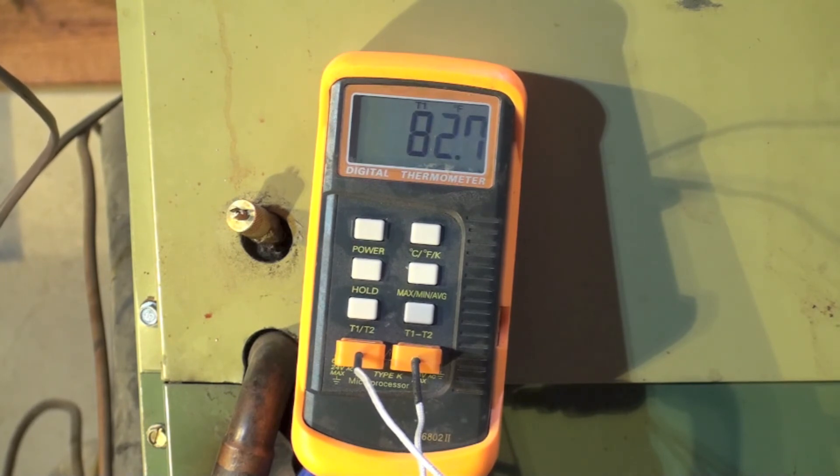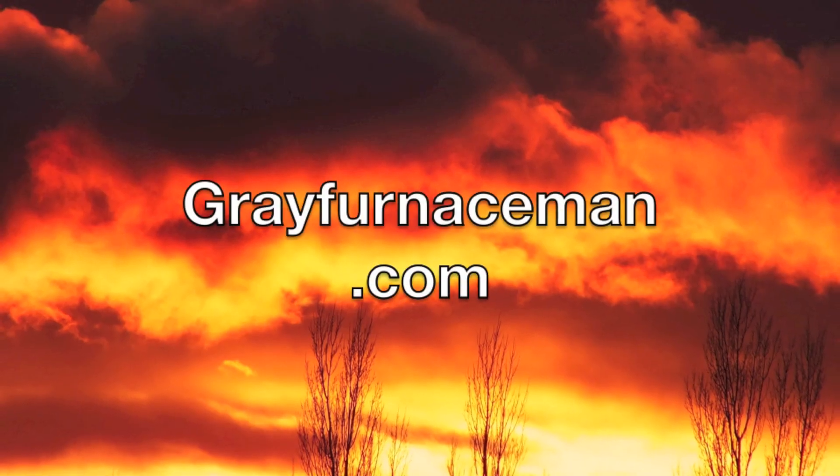82 and a half is a pretty low temperature to be sending into somebody's house. It will heat the house because it's warmer than the return air at 67, however it is going to feel cold to the customer. Once you reach the lower 30s in your outdoor temperature, you have a choice to make — or maybe your customer has a choice to make — on whether you should continue running the heat pump. The compression ratio is getting wider as the outdoor temperature drops, so you don't get as much heat. A lot of pumps probably shouldn't be run much below about 30 degrees — that's my opinion.